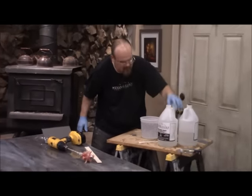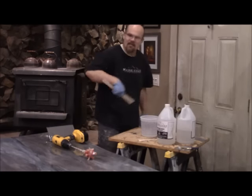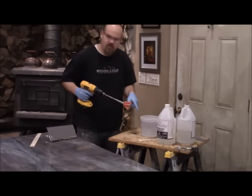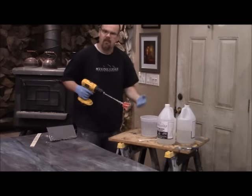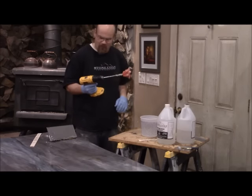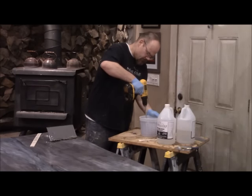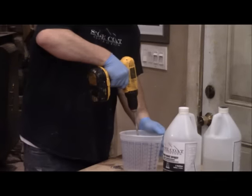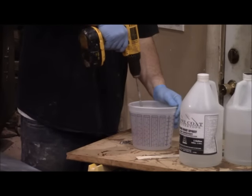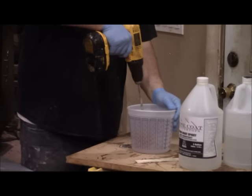I'm measured really accurately, and now instead of using a stir stick for 10 minutes and getting carpal tunnel, we use a jiffy-type mixer. The important thing when you use a jiffy mixer is you need to slow down the drill and rub the sides and the bottom of the container. I've used this paddle over and over — it's got lots of drips on it and I think that actually helps mix better. Pull the trigger full speed at first — the material turns a little milky and then clears right up as the two parts start to mix. Then slow it down and start to rub the sides and bottom.